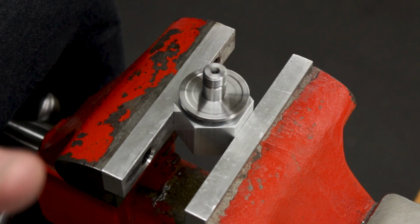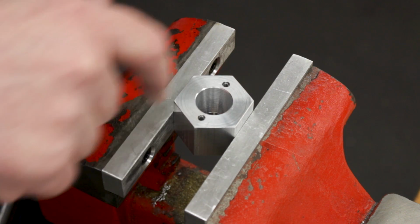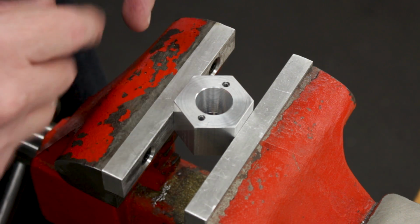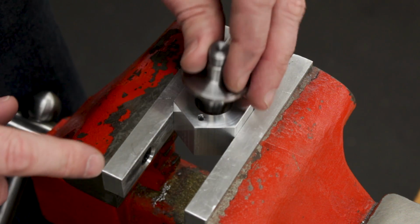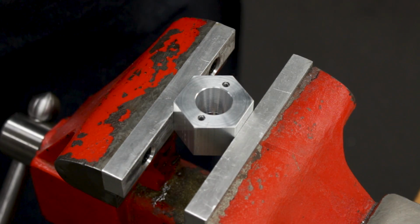Now, it doesn't matter at all for this application, but I learned something there: that an aluminum part this size and shape with a hole through it, with the power you have in a mill vise, you can easily push it out of round. So in this case, it's not going to matter at all. And if it really did matter, I'd just squeeze it a little harder in this vise and bring it back into that shape. So let's put in the pins.